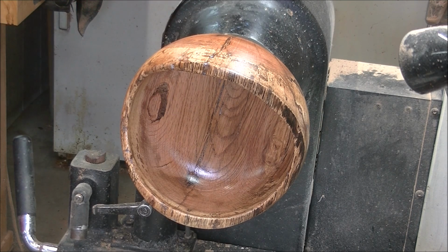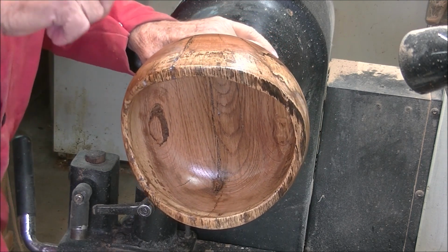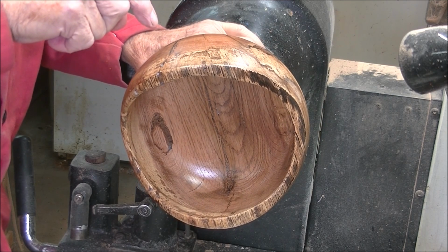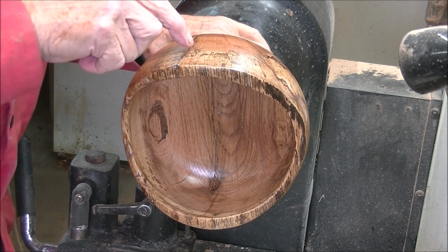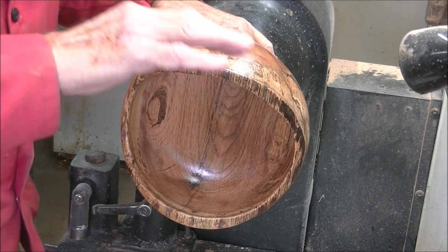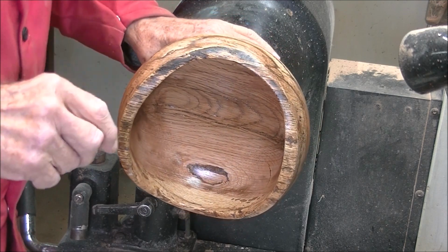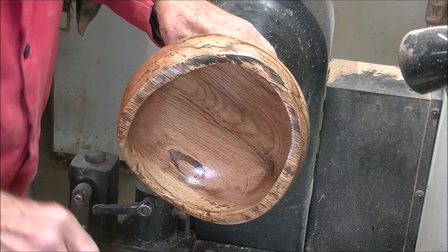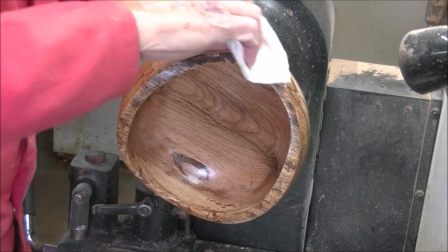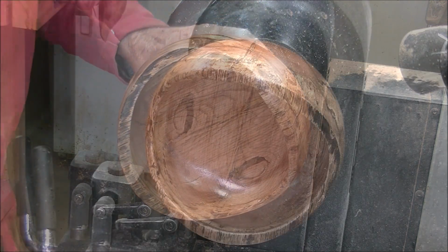I mean, I see people put 1 coat of sanding sealer. I personally don't think that's enough because if you look at it close, you can still see holes in it where the grain runs. So the sealer hasn't really smoothed it over. It hasn't sealed it, in other words. So, I mean, that's the idea. Sometimes with 1 coat, you miss little spots.